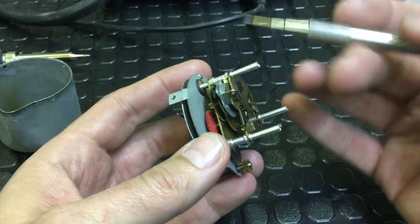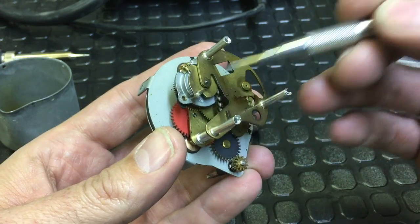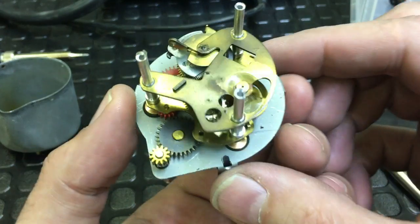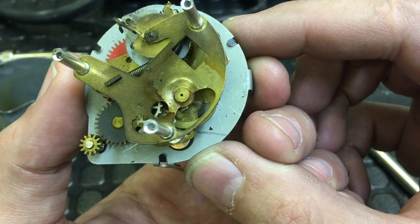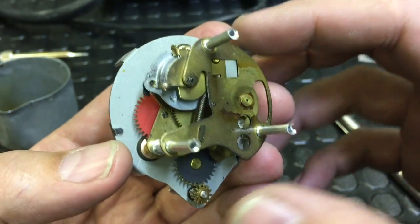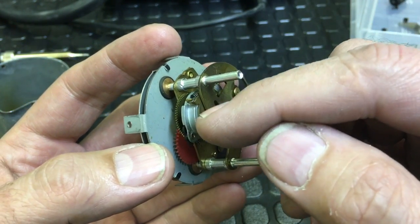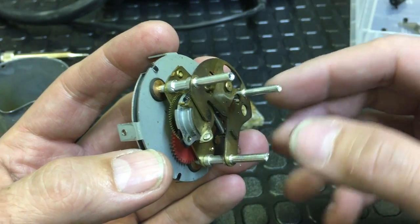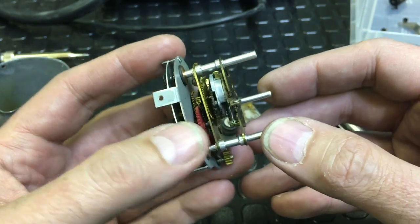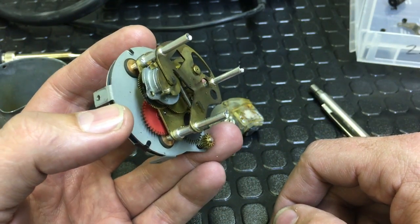Right now the clock is not working. If I take this winder and rotate it about 30 degrees or so, you see the clock is functioning. You can see the movement is doing what it should. The issue is after about 30 to 45 seconds, the energy stored in this spring runs out. What's happening when you move the winder is you're pulling the spring, storing energy, and extracting that energy off the stretched spring to run the clock. At some point the winder is going to come back to the rest position and the clock is going to stop.